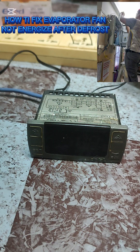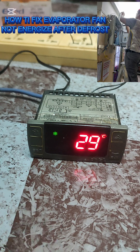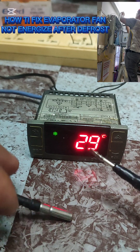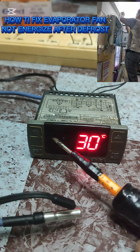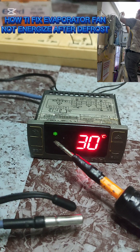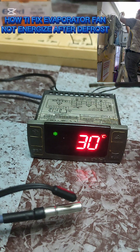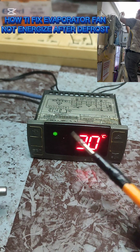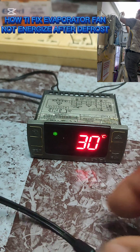We're going to restart and I have a one-minute time delay for the activation of the compressor. Here are my two sensors - they sense 29 degrees Celsius. I'm going to tell you in advance that the evaporator fan will not turn on, because I activated the evaporator sensor. Terminal number 10 is the evaporator sensor and terminal number 12 is the room sensor. Take a look - it didn't activate for the evaporator fan.